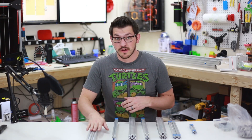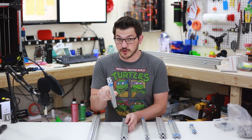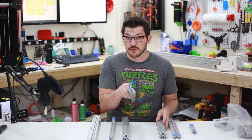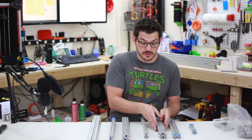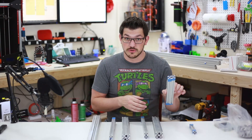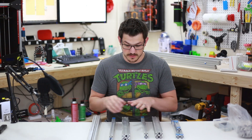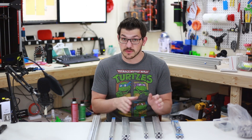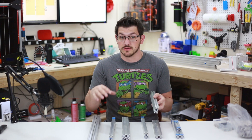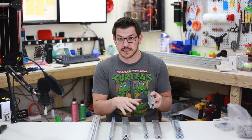Now let's take a look. We have four 500mm 2020 extrusions, two 340mm 2020s and two 340mm 2040s, two 303mm 2020s, and the two 285 and one 135 for the bed. Someone replied online and I'm going to use the 2040s for the base frame around the Hypercube — that gives a little more rigidity and more mounting options for the electronics down there.